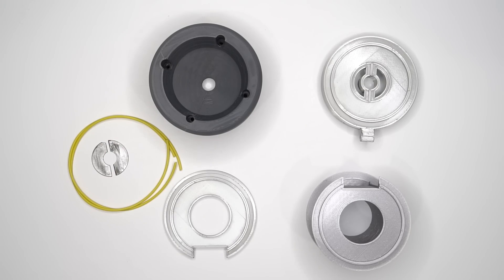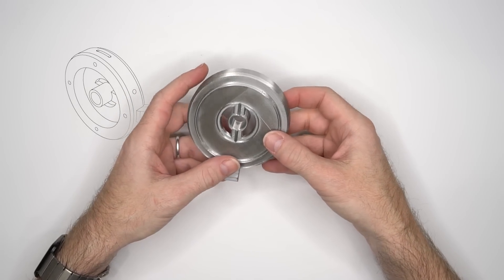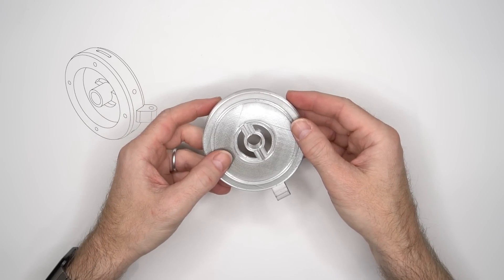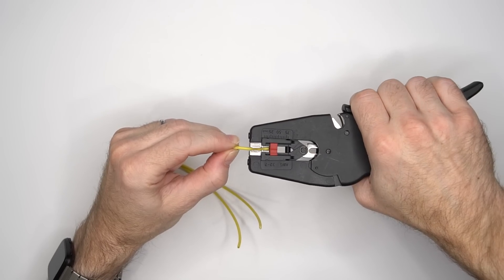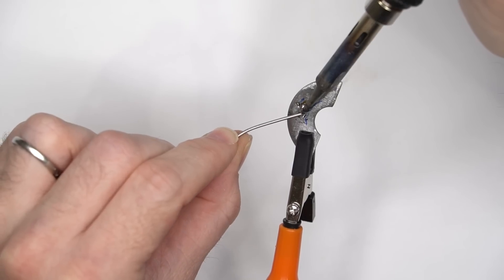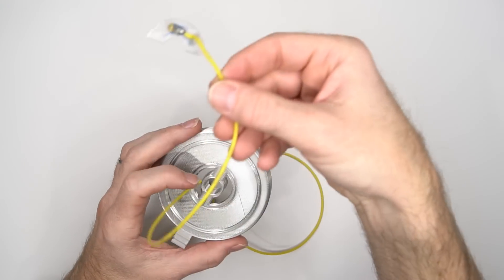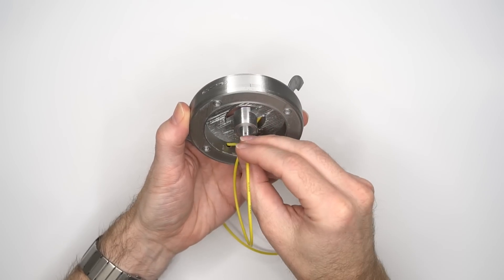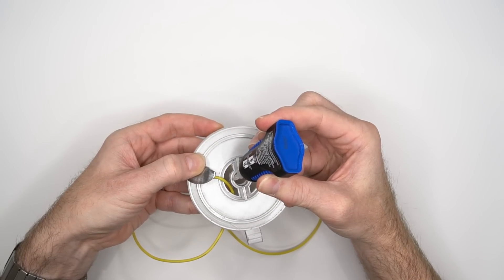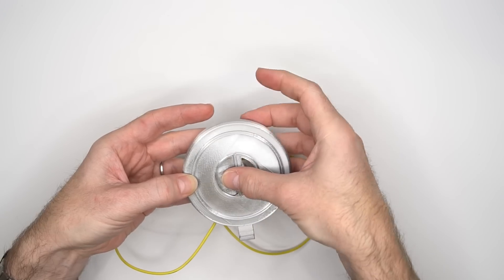We'll start from the back first with the exhaust nozzle and ignition assembly. I've changed things up a little for the ignition assembly so I can actually make it work for the final build. You can also see on the back that it's not a flush piece — all of the components in this build now feature flanges to make sure those hot gases don't escape. It's time to begin adding wiring, starting with soldering connections to the two halves of the washer. Each wire coming off the igniter will make contact with the washer half and pass the necessary energy when the trigger is pressed. There are a lot of ways to bond plastic, almost none of them good, and I'm sure there are ways to bond metal to plastic as well. I'm perhaps as surprised as you that cyanoacrylate superglue worked just fine.